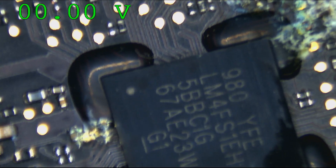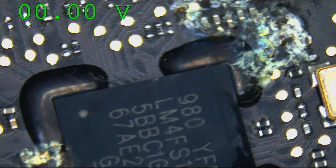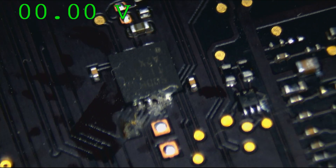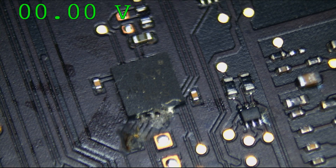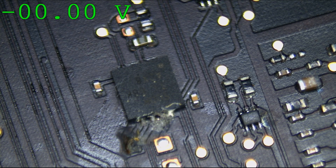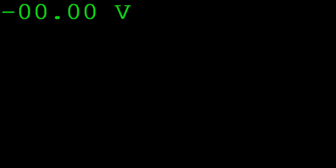The SMC could not be turning on, or it could be bad. When you look at how much corrosion is by the SMC, it could be failing as a result of corrosion, or the reset circuit — which is supposed to turn the SMC on — could not be working. Let's take a look at the schematic for an 820-4924 board and look at the SMC reset circuit.